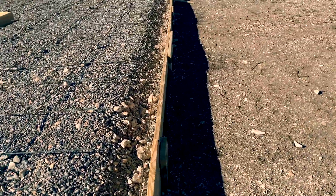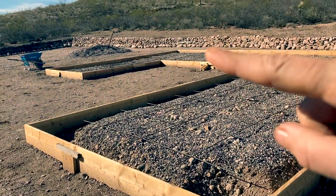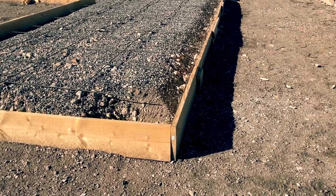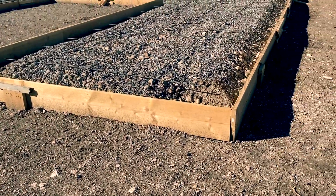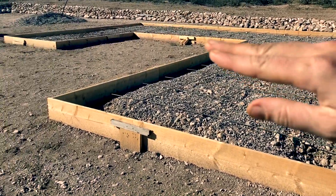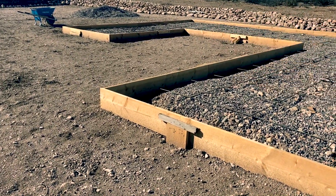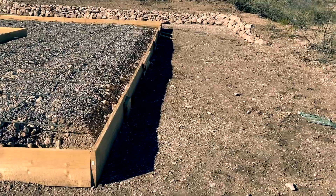After I constructed the form — which I actually had to do twice, because the first time one end was about three inches higher than the other — I'm now within acceptable tolerance, which is off by about a quarter inch across 10 feet in any direction. You're never going to get it 100% perfect but you want to get as close as possible. I also think there's just ever so slightly a downward slope from one corner to the far corner, and that's actually a good thing because I'm building a low slope roof and that's the corner where the water is going to drain, so it should help get the water going in the direction I want.